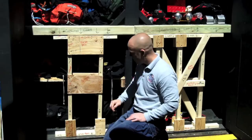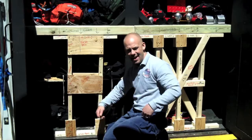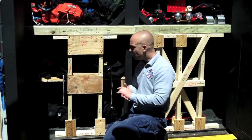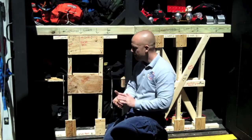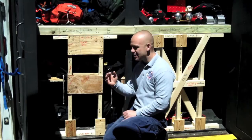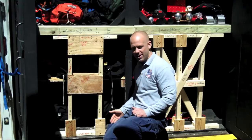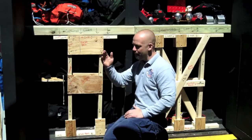Plywood into dimensional lumber is all 8D nails. Behind these half gussets are 2 by 4 wedges. The job of these wedges is we'll slip them underneath the verticals before we make these connections and drive them together. When we drive them together, it creates an upward force and downward force, which snugs this shoring system into place. We're not looking to move this — we don't want to snug it so much that the load we're capturing starts moving up. We want to keep it where it is and catch the load where it is. Outside of constructing this perfectly to all the standards, the next most important thing is to make sure this shoring system is plumb or perfectly straight. Gravity wants to come straight down, and if this shoring system is kicked out, gravity is going to want to kick it right out. So bring your level out, make sure it's nice and plumb, and set it in place.